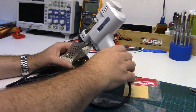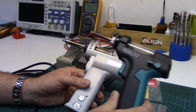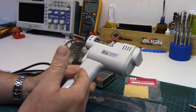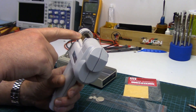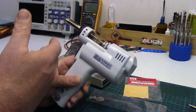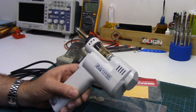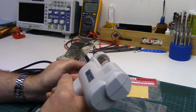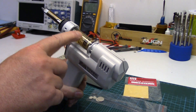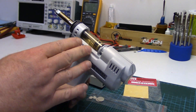Finishing up with a few final thoughts on the S993A desoldering gun. Overall, not bad — it worked, as we saw. It didn't have as much vacuum as the desoldering station, of course — much smaller pump, so that's to be expected. I was using it more last night and found the odd time a molten blob of solder would get stuck in the end of the tube, and I just had to hold the vacuum on a little bit longer. That's probably due to the lower vacuum. The idea is when you come off the circuit board, keep the vacuum engaged a little bit longer so it doesn't get blocked. We don't really know about this plastic accumulation tube and how long it's going to last — these things do crack, but only time will tell.